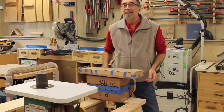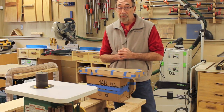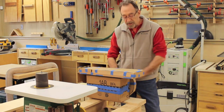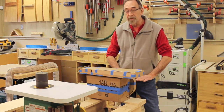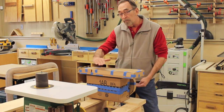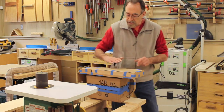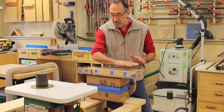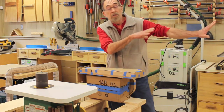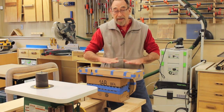Pretty good, huh? There are really four different operator positions for a combo sander like this. There's the disc over here on this side, and there's a work table that goes across where you put your material. It's about halfway down the disc. That's a little low, but it's a good compromise since there's two working heights here on this combo sander. The other position that you'll use a lot is on the top, on the flat part of the belt. There's a work stop here on the end that keeps the material from shooting off because the belt is spinning this way. So that's about perfect.